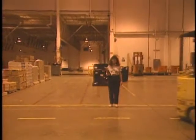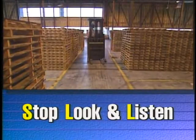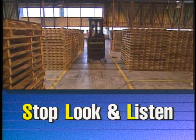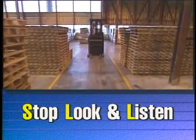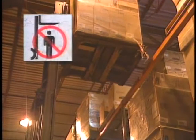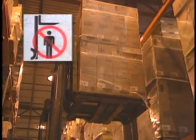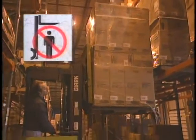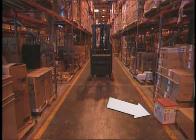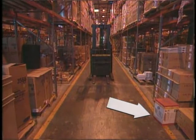Act as if you are crossing a city street. Although these trucks are very maneuverable, they can't stop on a dime. Use all your senses to assist you in staying clear of lift trucks while walking or performing your work. Don't only rely on sounds — some lift trucks operate on batteries, and you won't get the warning noise that may come from an internal combustion engine. When you spot a lift truck that has the forks raised, stay clear and avoid walking or even standing under or near the truck. The operator may be so intent on the load that he may not see you walk underneath. Also, material may fall off. The overhead guard on the truck gives the driver some protection. However, should any material fall, you could be seriously injured. Don't leave materials on the floor, in aisles, or in any area that may hinder safe operation of the truck. Remember that good in-plant housekeeping is not just for looks — it is an important safety function.